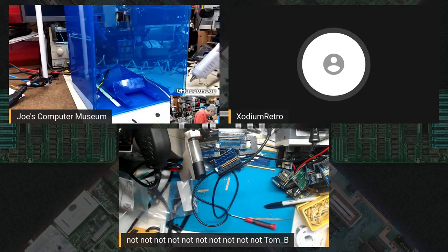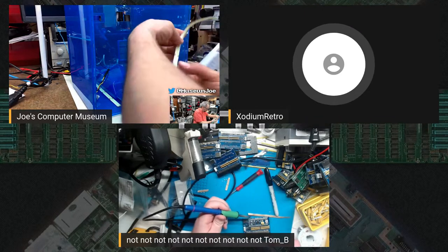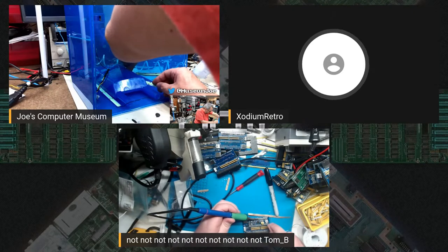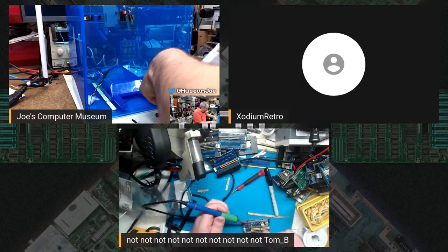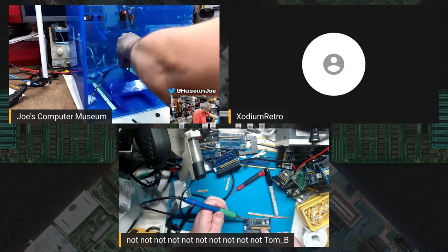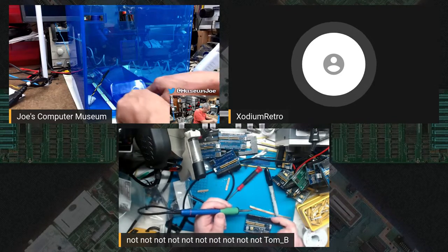I had to look it up, but one of the things I would be paranoid about in changing out my SE case is this: my friend bought a Mac Effects case. That's how I got a relatively decent condition SE case. But when he was putting his Mac Effects case on, he messages me, he's like, I think I really messed up. I was like, what did you do? He's like, I broke a cable. Is this important? And takes a picture. He broke the anode cap. No! Actually, I was able to go over there and re-solder it all back together, and it works. I was like, okay, this is stuff I really don't want to mess with, because this type of voltage will very much enliven your day.